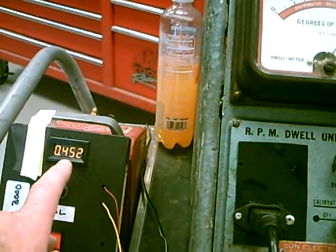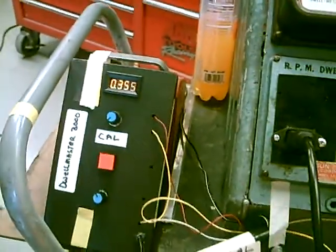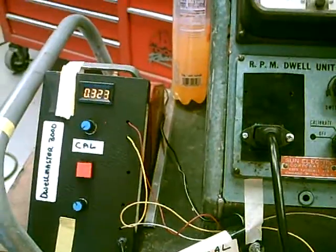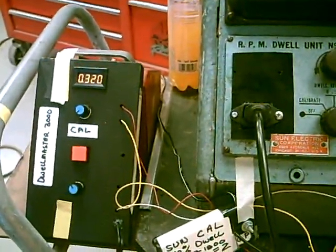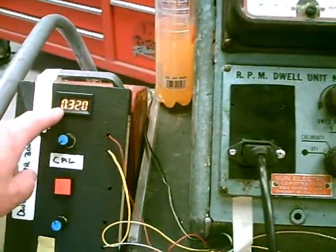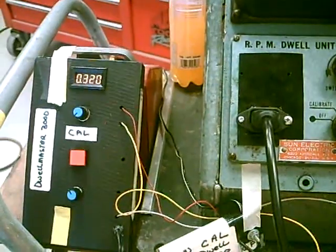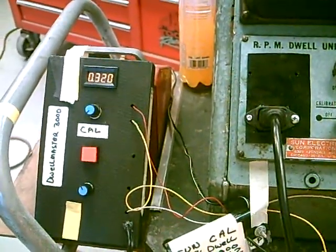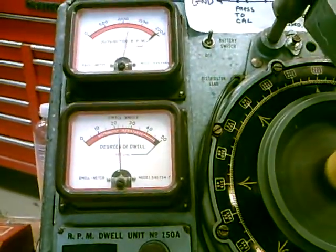Or you can even make it 100 if you want to do purely percentage. There's a precision reference in here. Once you set this up, you can come back on a cold day or a hot day — doesn't matter — this will still be in calibration. The single pot makes it easy. These meters are only a couple bucks, and all the electronics will be less than $10 a unit. It's a fairly easy process to convert these to something electronic.